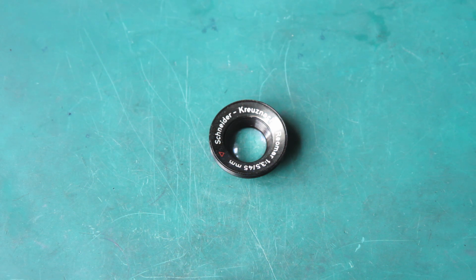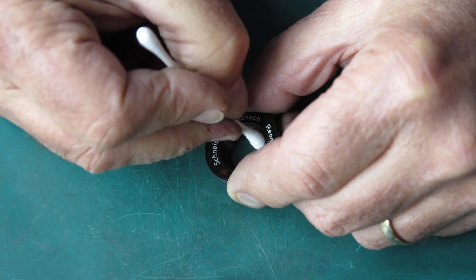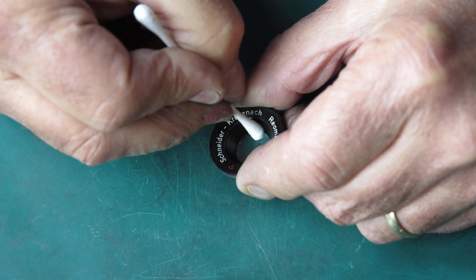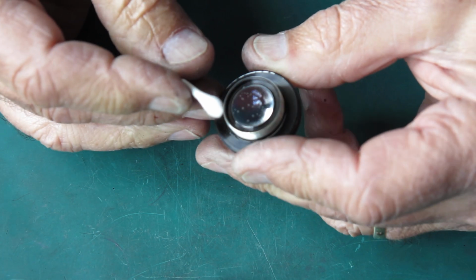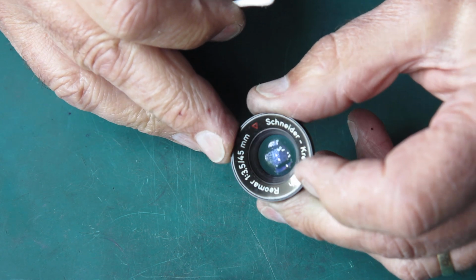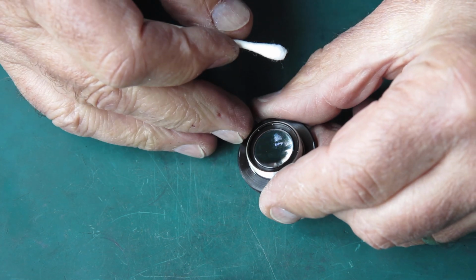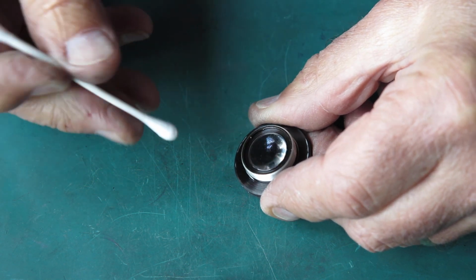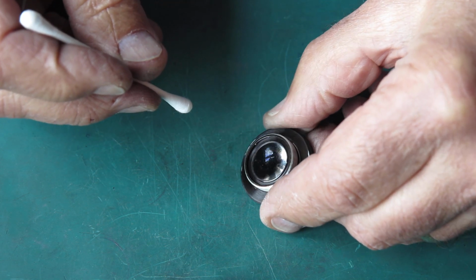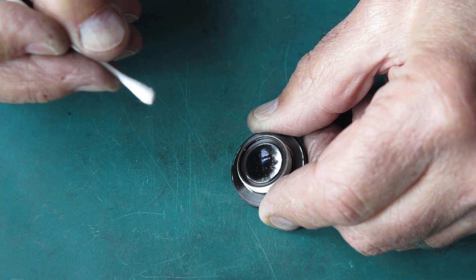And I'll just very lightly dampen the cotton bud. Wipe that surface, rotating it as I go, and wipe that surface dry with the other end of the cotton bud, and that looks absolutely awful. Just look, those bright dots that you see, they are reflections from this face, and they are problems with the coating there. Whether that was a fungus or whether that's damage from something, some liquid that is sprayed on there, droplets of something that have caused that problem, I don't know. I think even if I put a high-powered glasses on, I probably couldn't tell.